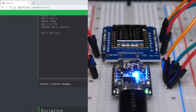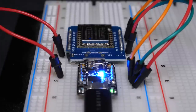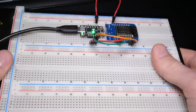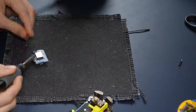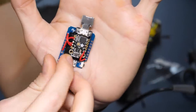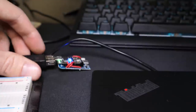In this configuration, even the RGB LED on the Trinket works without any modification at all. This setup will run just like the Malduino W, as they're running the same code. The only other thing left to do is fix this mess — it's really not all that practical to carry around, it's slightly cumbersome. So I set to work essentially remaking the same thing, except without the breadboard. I cut some jumper wires to size and soldered those connections, and put some electrical tape between the boards to prevent them from shorting out. When done, I put one of these micro to full size USB adapters in the micro USB port, so it can be used essentially just without a cable.